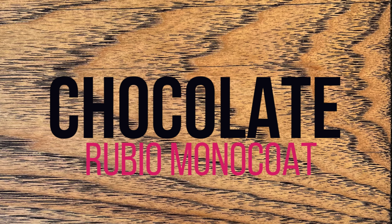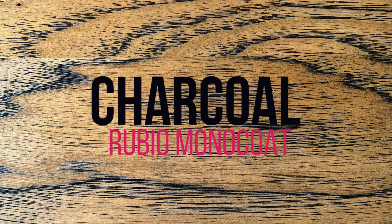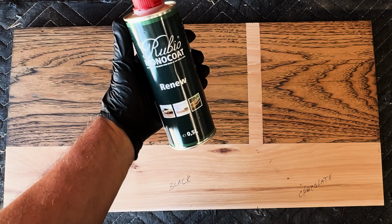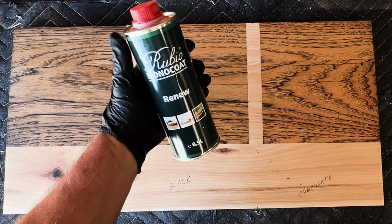Alright, so as you can see, there's not a lot of difference between these shades, and that's predominantly because of the species of wood that I'm working with. Hickory's very hard and doesn't take stain very well or any other color, so that's why there's such a subtle difference. But ultimately, we're going to go with the charcoal, because it most closely matches the client's coloring of the wood products that they have in their home now. So next up, we'll apply some maintenance wax, as I mentioned earlier, and we'll finish this out and see what it looks like.